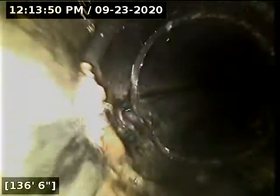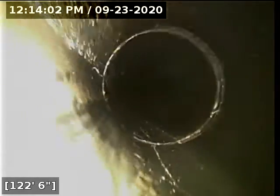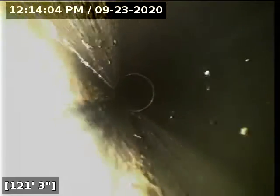You've got about 2 inches of standing water there in that section of the line. And there's a lot of gravity behind that too. You've got that hard dive just before it. So, like I'm saying, you would be repairing that to prevent a blockage from occurring from someone who's just kind of abusing the sewer line.